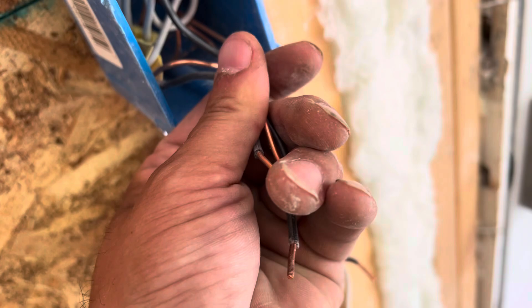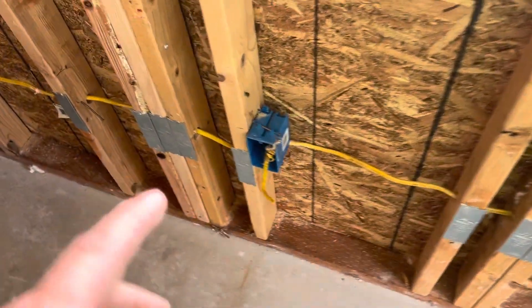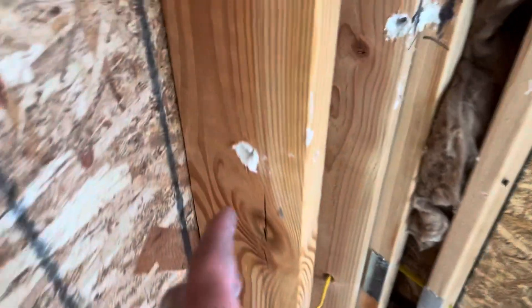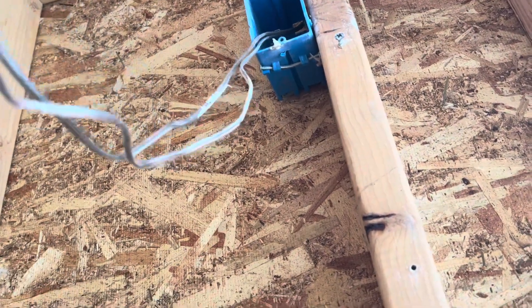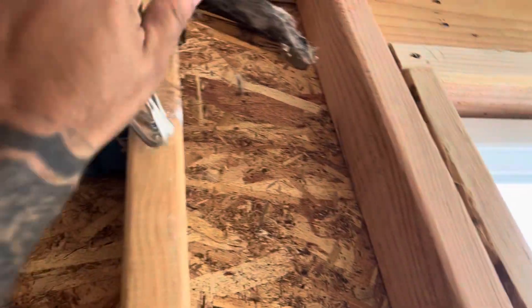He didn't have time to get here in time for me to be ready for drywall by Monday, so I used some of the scrap wire, jumped it from here to here and here to here, and then I was able to back the old wire out from the original holes, which were right here — I just backed it all the way out to here. Then I drilled new holes and ran it through lower so I could get to where I needed. This right here is just for speakers — they want to leave those in there, but I don't like how this box is set; it's all crooked. So I'm going to use one of the old boxes, put it up there, coil these in, and just stuff them in there so they're accessible.